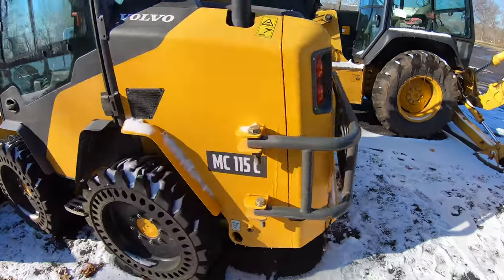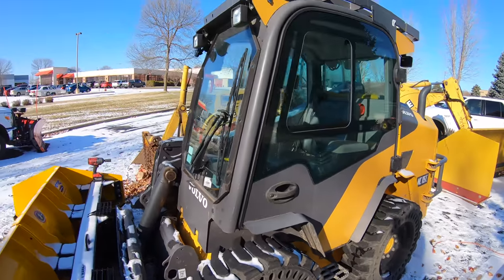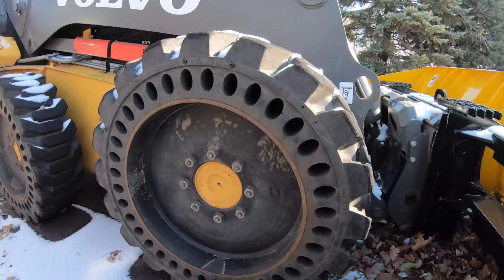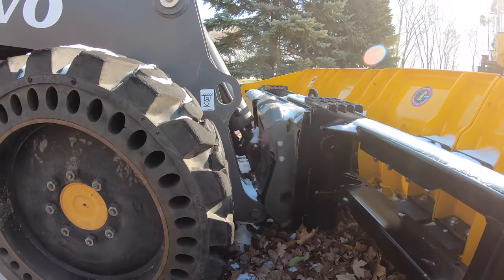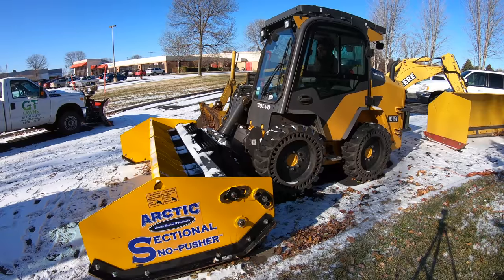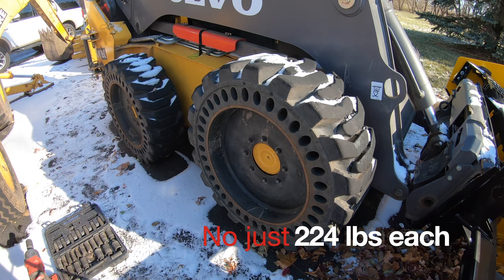So it's that time of year — I'm going to be prepping the Volvo for snow here today. That entails swapping out the tires. We got to get these solid rubber demo tires off because they're going to be slipping and sliding in the snow. I took the hockey mask off the front earlier. With the front we can lift it off the ground with the bucket, then drop it and jack the back up. When you're jacking the back up, you want either the attachment off or lift it up a little bit, because if it's touching the ground the jack is going to be lifting the whole weight plus the weight of the attachment. Each one of these tires weighs about 250 pounds, so you have to manhandle these suckers off.